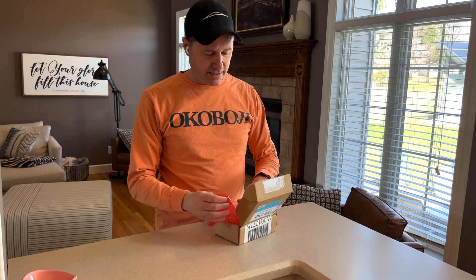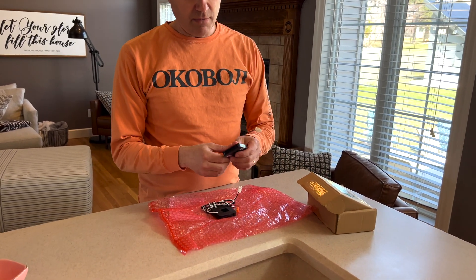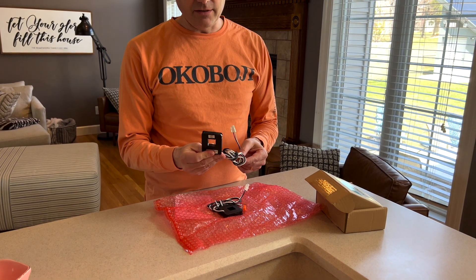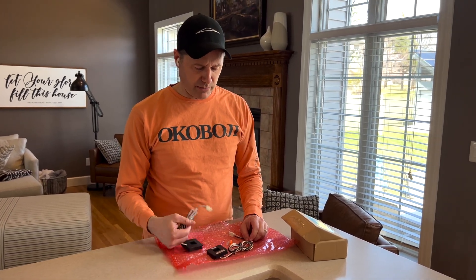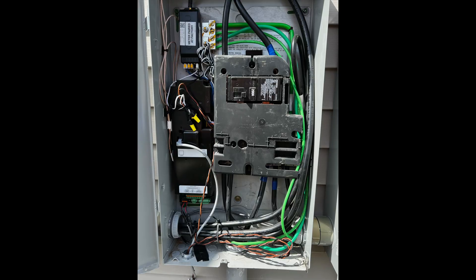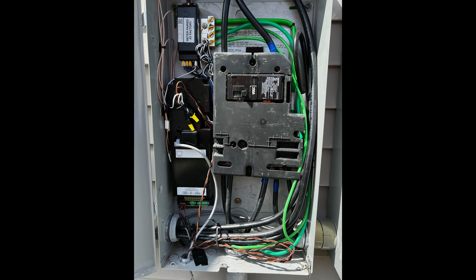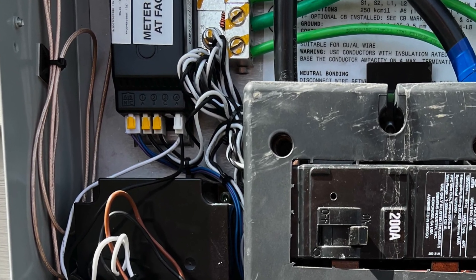Here's the box of CTs that came in. They're just a sensor that goes over the power coming in from the solar, and then there's a low-voltage line attached that gets run to the gateway. Then the gateway knows how much power is running through that circuit and populates that information in the app. You can see that plastic square going over the power coming in with black and white low-voltage lines running to the gateway - they're spliced with black and brown because they weren't long enough. Those low-voltage wires run into the Tesla gateway and plug in right there at the far right white plug.